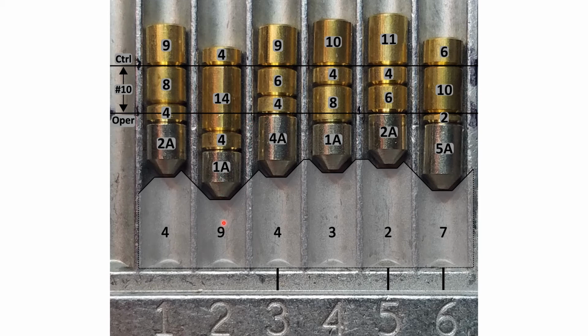Now this is a very interesting chamber, because here, when I started, this is just a very small lift. I just raised the pin stack a very little, and I've hit control shear line first. I have not lifted far enough to hit number 5, which should be this 1 plus 4, well, that would be a 5, or even lift it higher all the way to a 1, which is hardly any key cut at all on the key cut, but it really lifts the pin stack really high to a 1.